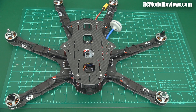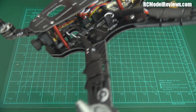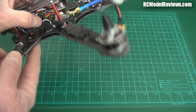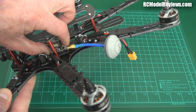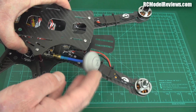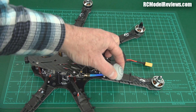Apart from your receiver, transmitter, and FPV glasses or screen, because it has onboard a camera — a little board camera, supposedly a CCD. It looks pretty budget, but you can't necessarily tell by looking. It also has the 200 milliwatt low-cost video transmitter, which I've reviewed and they actually work pretty well. One thing I'm not impressed with is it's simply held in place with a piece of double-sided sponge rubber, which means it can just fall out. Maybe put a cable tie over it. There's also no mention of whether the antenna is left or right-hand polarised, and that's important — if you use one polarisation on your video transmitter and another on your goggles, you're not going to get very good results. They should label whether it's left or right.